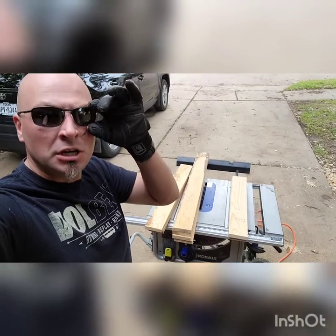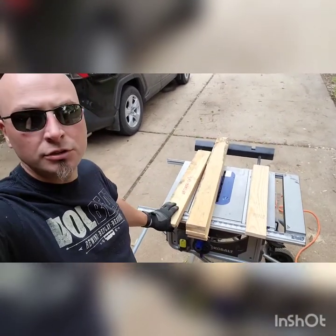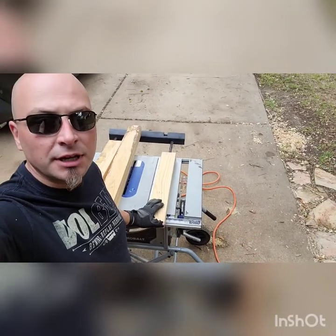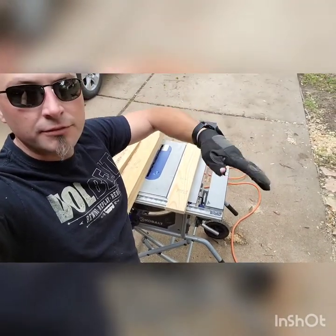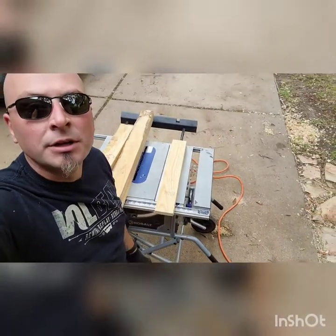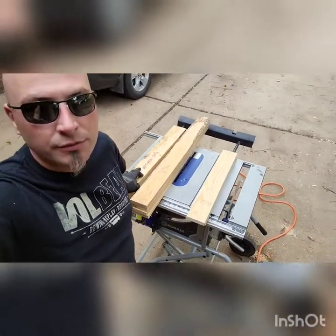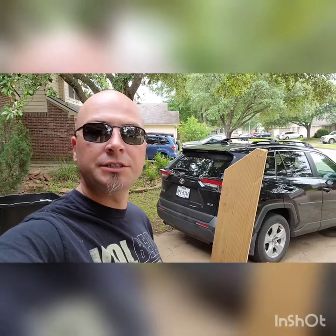This video is going to be a little faster than normal because it's getting ready to rain. I've got four boards cut to 36 inches long, two boards at 28 and a half inches long — that's the inside span of my rabbit hutch on the bottom — and two boards cut to 23 and a half inches long. These get narrower so the chute gets narrower, forming a trough that funnels everything down toward the bucket. The lengths I'm using are 36 inches, 28 and a half, and 23 and a half — yours will vary depending on your hutch size.